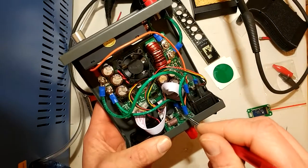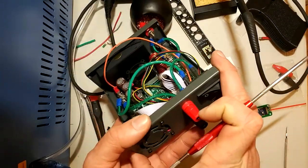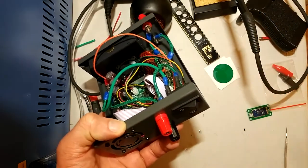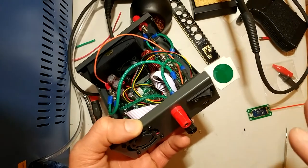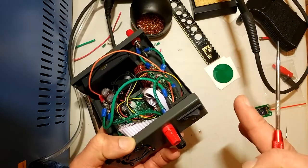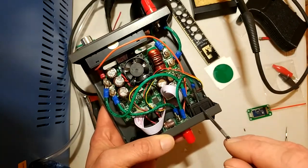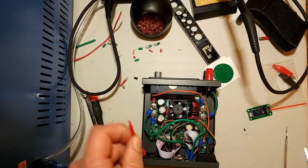Most people have taken a thin wire and just done these connections with thin gauge wire, under the assumption that the board is doing some logic and this switch is not carrying the current. But that's not correct. I can see why you might think that — this board has a big MOSFET on this side behind the metal casement, and you might think that MOSFET is switching the entire power. But you'd be wrong. That MOSFET is switching the power for the fan, and it's probably huge not because it takes 20 amps of current, but because it has to withstand the full 60 volts of input. If you ohm it out and check what connects to where, you will see that you need the amperage for the main supply board to flow through the switch. That's also why they provide a 20 amp switch and heavy duty gauge wire.